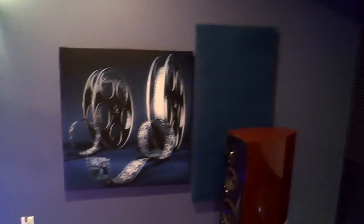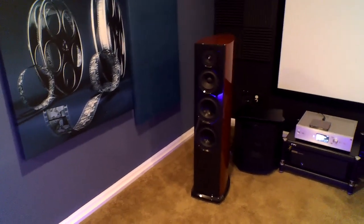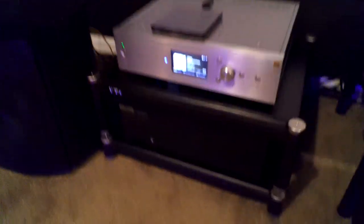There are my absorption panels on the side wall over there, some on the back wall too, and up above on the soffit. I took the better part of a day positioning these speakers to get the best performance sound-wise out of them. They're bi-wired — those amplifiers have two sets of speaker binding posts. I have the MIT Shotgun speaker cables connected to the mids and highs, and then I have the Oracle speaker cables on the bottom binding posts for the woofers.